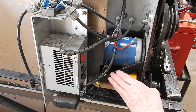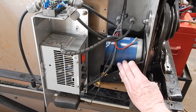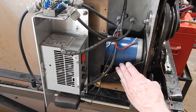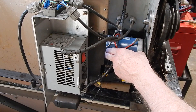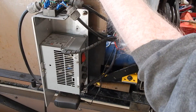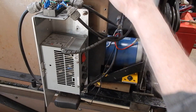There's the new motor — it's a beauty. It's the same cradle I used before, a base mount, and it fits beautifully. It's longer than the last one — a heavy duty, big hunk of motor, probably a good quarter longer than the previous one. I'll have to move the inverter up higher because the air intake port at the back of the motor comes out about here. I might swing the inverter anti-clockwise so the bigger heatsink on the back is facing up, which will also act as a good chip guard.